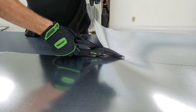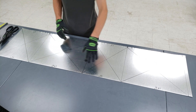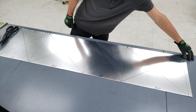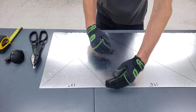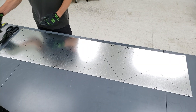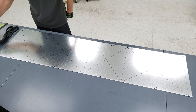I've already cut out our piece of metal out of our four foot by eight foot sheet of metal. We're making a 13 inch by 19 and a half inch plenum box — 13, 19 and a half, 13 and 19 and a half — and then we have a one inch right here that's going to be used to wrap it into a box. This plenum is going to be 16 inches tall, so we actually had to cut this at 16 and a half because we're going to bend our half inch flange down here. Before we use our pocket brake to bend this all out, I just want to cut our half inch pieces here, and then we're going to get started bending.